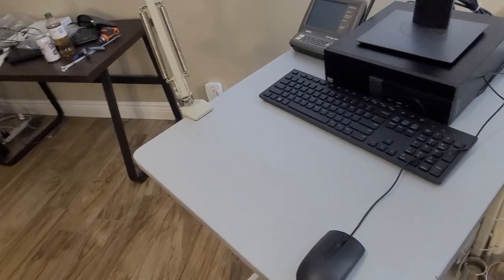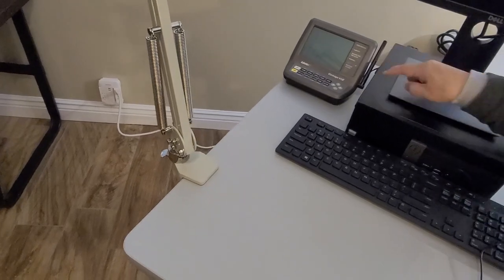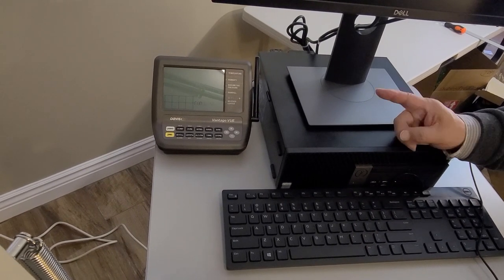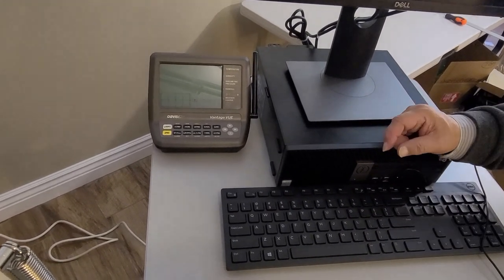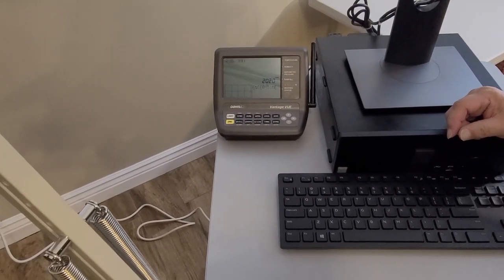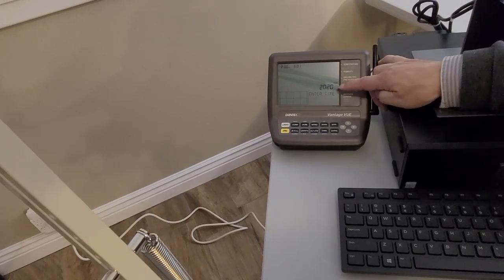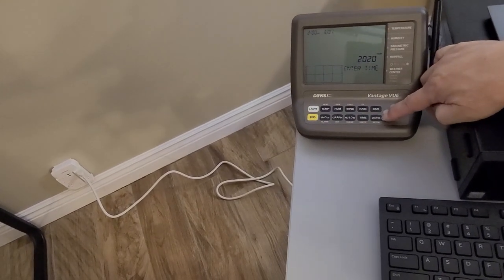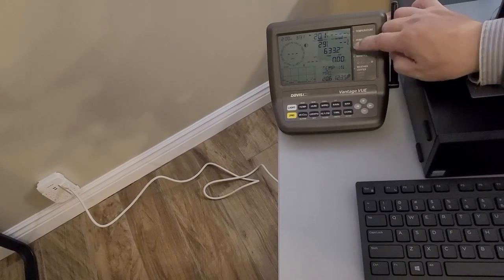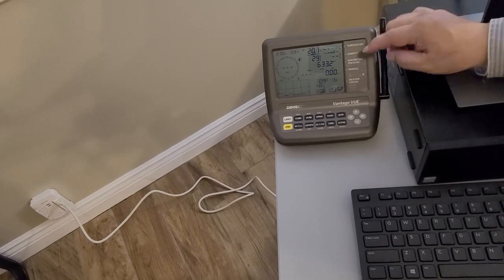After you plug in, you will hear beep 3 times. After that, it will say, thanks for choosing our weather station. When it says enter time, you should not enter time. Instead, you should press and hold the done button for 3 seconds. 1, 2, 3. Then you will get into operation mode with temperature, humidity, and the barometric pressure.